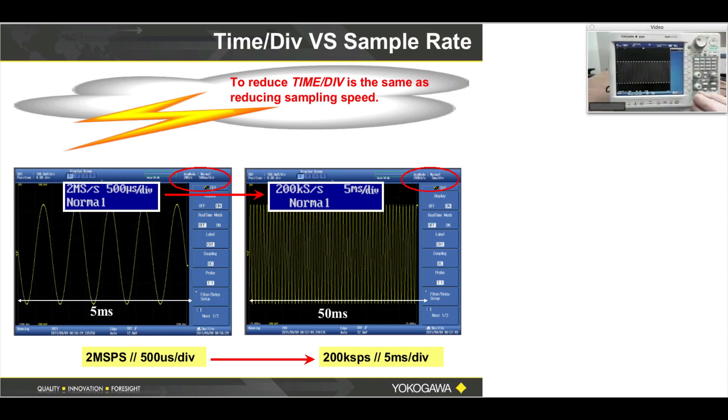I'll show you later the mathematical formula that relates those three things to each other. On the horizontal axis, time measurements can be affected by sample rate when measuring cursor to cursor. On the vertical axis, in terms of waveform integrity, I have a rule of thumb: a factor of 10 times sampling rate — 10 times your fundamental frequency. We're experimenting with a 1 kHz pulse from the probe compensation waveform, so a factor of 10 is very easy to meet. With the DL-850 I like to maintain high sample rates at all times; this only becomes an issue for very long recordings.